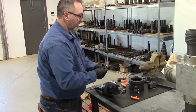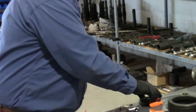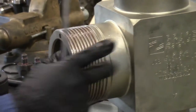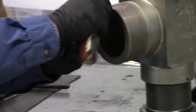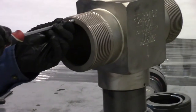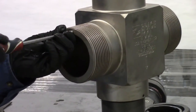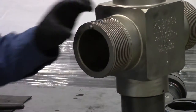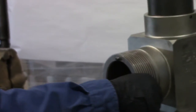Then we'll install our alignment pin — it's a small alignment pin that lines up with the hole in your piston housing and onto your wireline valve body. This ensures that everything is aligned correctly inside the wireline valve body. It doesn't need to be over torqued; it's got a slot head in it, so if you over torque it you can flare it out.